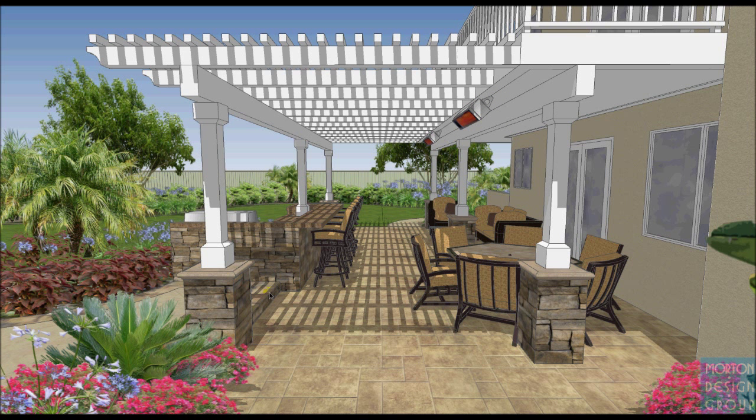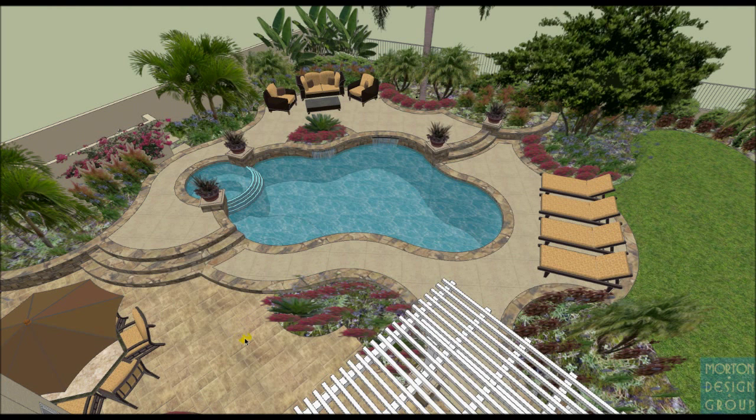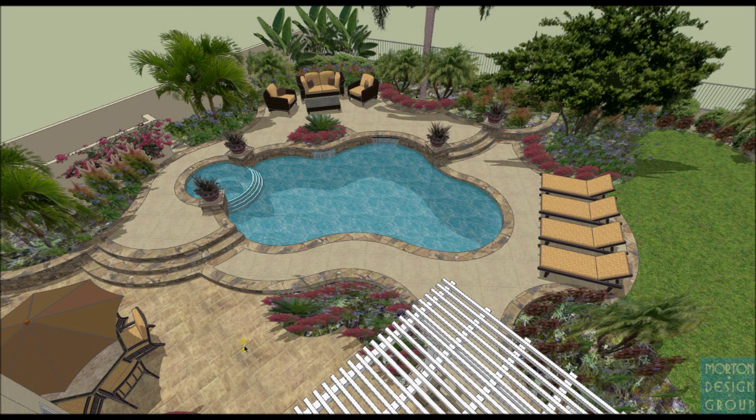There are heaters up here, and this is a step up to the level of the pool deck, which flows onto the pool — the pool is six inches higher than this deck. This material is either a slate, ceramic tile, or travertine that would tie in with the stone. The idea is to keep as much of the existing concrete patio as possible and overlay it. Where we extend beyond the existing concrete, we'll pour a new concrete sub-deck and overlay that with the same material to cut costs and get a rich look.